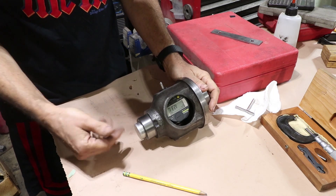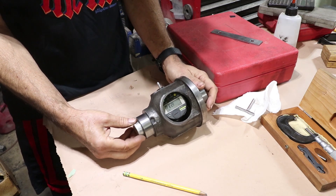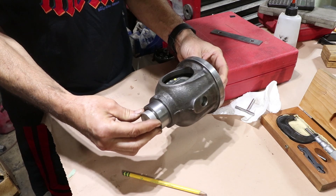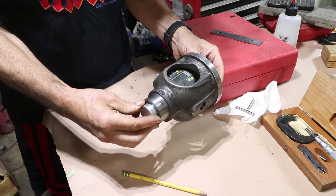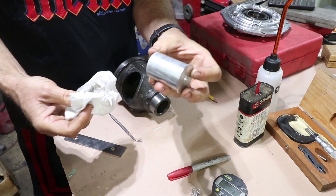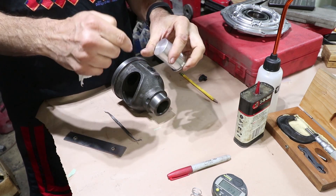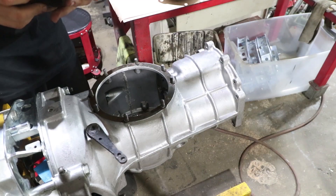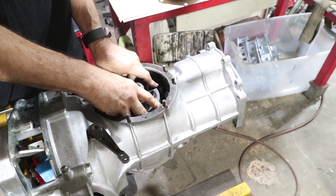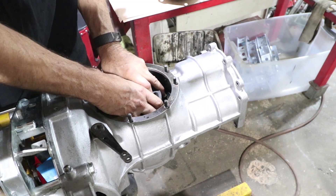I also have this piece of aluminum — I used it when spinning this on the lathe. I've inserted it from this direction so I can use it as a handle to rotate the carrier. This is going to make contact with the pinion gear and I'll have to rotate it to find the minimum number. I'm also going to glue in a piece that sticks out and attach a knob so I can physically turn the carrier from outside the transmission. I'm getting ready to drop this in and take my first measurement. I honed the bearing surface down a little so it should slip in easily.